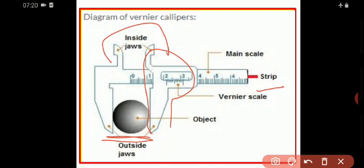As you keep on sliding the scale, this tail comes out. It is used for finding the height or depth of any hollow cylinder or a beaker. The vernier caliper is provided with a thin and long strip attached at the back. It slides with the vernier scale at the back of the main scale. When jaws J1 and J2 — the outer jaws — are in contact, the end of the strip T touches the end at the back of the main scale.